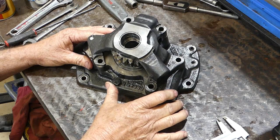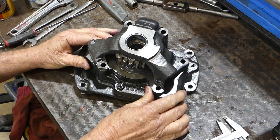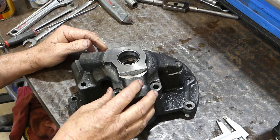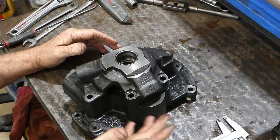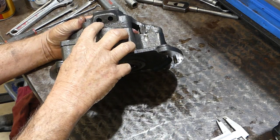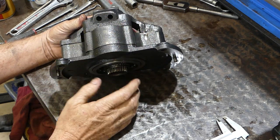On our 2030 series, which is my home tractor, my topping tractor — my slashing tractor, we call it in Australia. This is the transmission pump and the housing that takes the oil from your high-low, or from your shift cover into your high-low. These two pipes here, that's where the oil comes in from your shift cover. There's a couple of little pipes there.